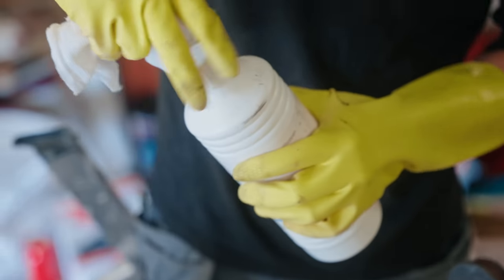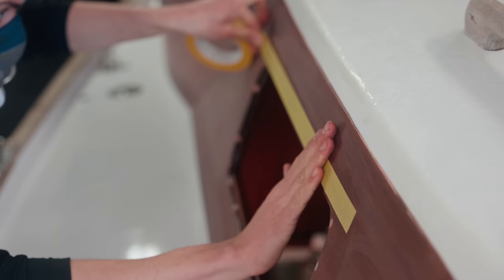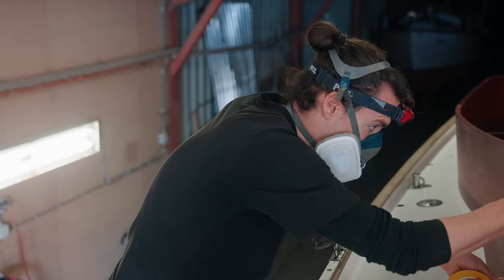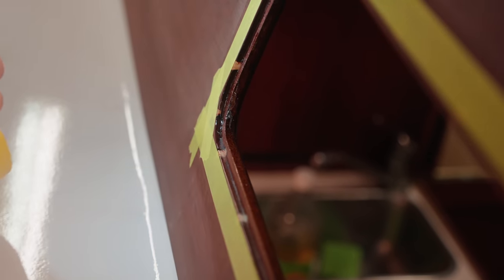The windows on these beautiful Vinda sailboats can sometimes pose a problem. Not only are they prone to leaking, but they can also endanger the mahogany cabin top since the frames are secured with screws. So Aladino filled all the old screw holes with epoxy, and he'll bed the glass down with Sikaflex for hopefully leak-free windows.